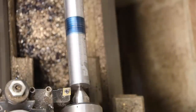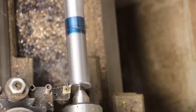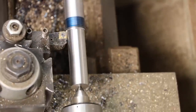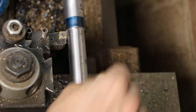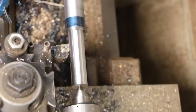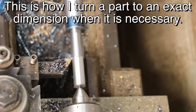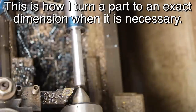I'm going to try a hundred thousandths cut — I don't know if it's going to do this or not. So I started at just under an inch, and I need to turn this down to 498 or just under half an inch. This part of the axle needs to fit precisely inside the bronze bushing that we machined earlier, which is exactly 500 thousandths of an inch. In order for it to spin well without a lot of play, this needs to be between 498 and 499 thousandths. I'm shooting for 498 and a half.